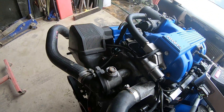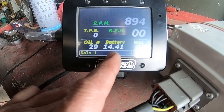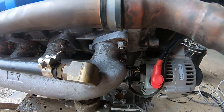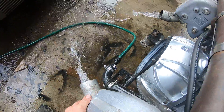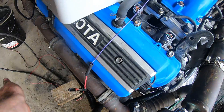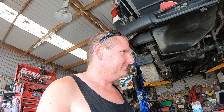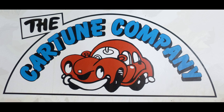Boat engine is hot. At around 30 PSI, water temperature is sitting at 87 degrees, the battery is charging. These are the exhaust manifolds — they are cold. Water out both sides, pretty much even. It's a runner. Ready to go back to the customer, be fitted, and we can do some boating.